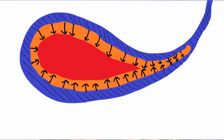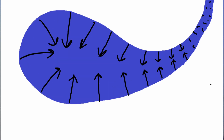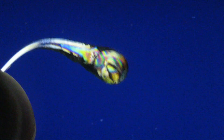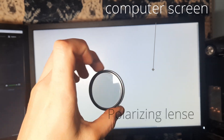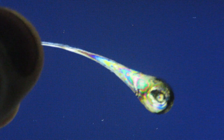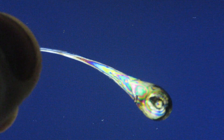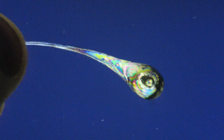The cooled glass on the outside is put under extremely high compressive forces from the slower contracting glass on the inside. These internal stresses can be seen visually when the drop is filmed between a polarizing light source and a polarizing lens. The different colors appearing are the different levels of stress in the drop — you can see how as the tail goes on, the colors taper with the tail, showing the internal stresses built up in them.